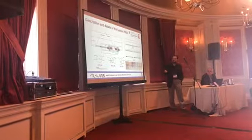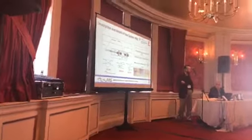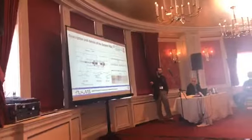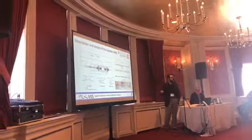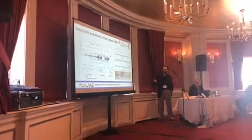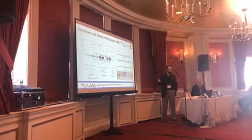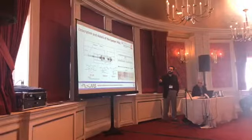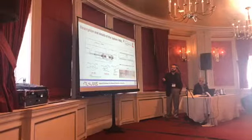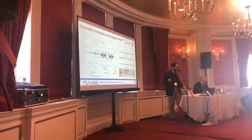So at any point of time of the loading, whether the entire system is under tension or compression, the SMA bars will only take tension forces, so that they don't buckle in compression. So we are just applying tension forces through the moving plate against the fixed plate. The nuts here provide some locking mechanism which transfers the force in bearing against these plates into tensile forces into the SMA bars.